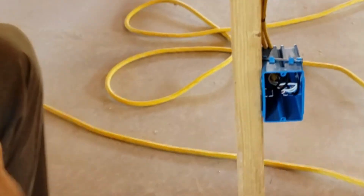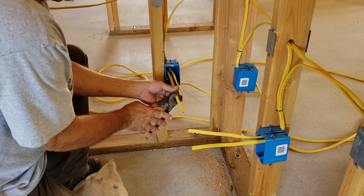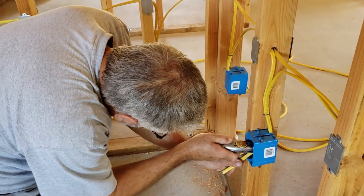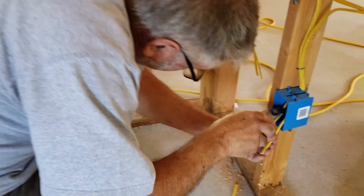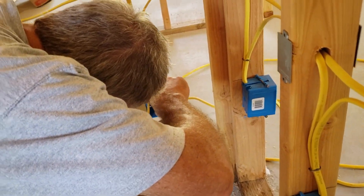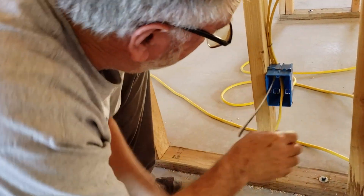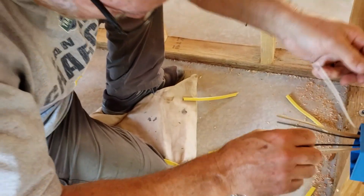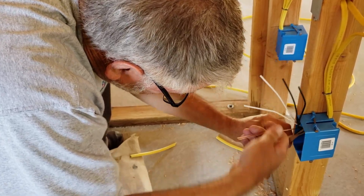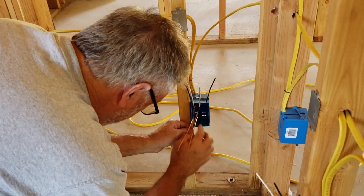Here's the last time through uninterrupted. Take those heavy-duty cutters and cut the wires off — right around six inches as mentioned. Reach in with the utility knife and score the yellow casing. We don't want to slice it, just score it so that when we pull on the yellow casing it rips apart where we put the score mark. There you go — it comes right off. Get all the blacks and whites out of the way so we can work on the coppers, and tear that paper off.